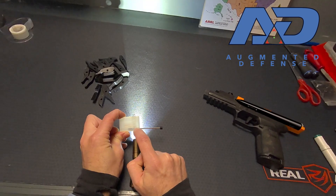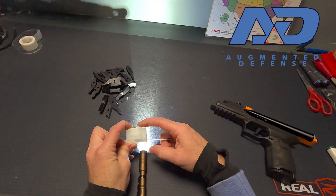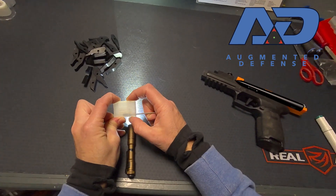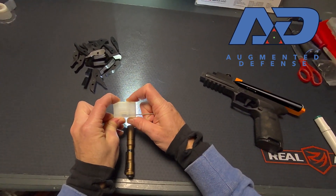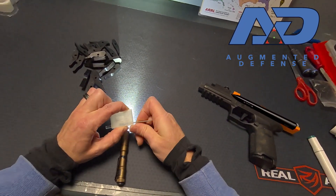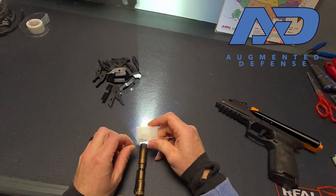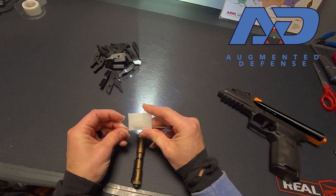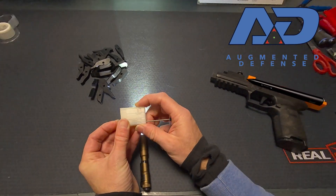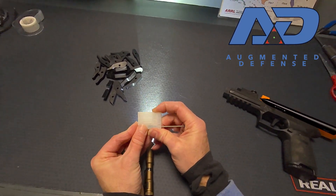What I did instead is also add a hole here, so you've got a 5mm ball bearing going up against this one as well. Where this rod comes up and pushes — this handles the pre-travel, the length of that. Our pre-travel comes up to here, and then I can stop all my pressure here, but you still have to push with force to overcome the resistance of that ball bearing. The tension between both these keeps the other bearing from dropping too far, so we have our break and reset.